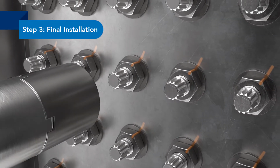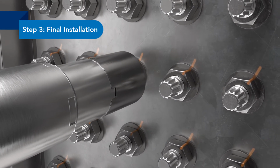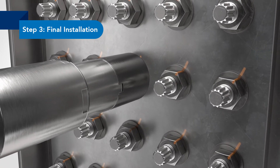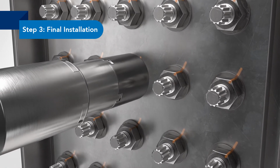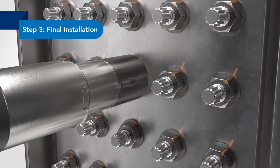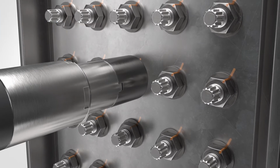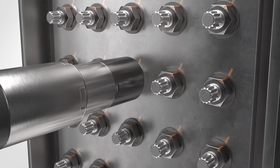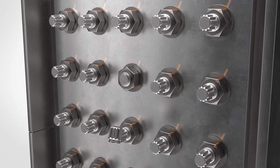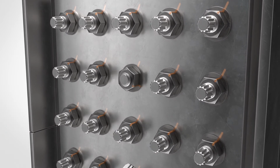Fit the inner socket firmly over the bolt tip and engage the outer socket over the nut by pushing the wrench. Pull the wrench switch to rotate the outer socket and tighten the nut. After reaching the designated torque, the pintail shears off at the notch. Finally, pull the wrench back to remove the outer socket from the nut. Press the tip lever and safely discharge the severed bolt tip from inside the inner socket.